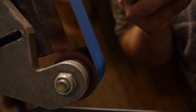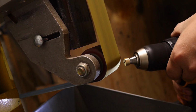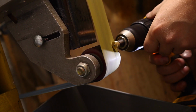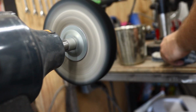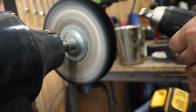The very last stage, I'm flushing off the end of that steel dowel with the brass, and then I'm clamping that brass nut in a drill in order to polish it. And I find a drill like this works as an awesome small device holder. Like, you've got this little mini vise there that you can use to clamp in little parts for polishing and things. I use it often, and it's just perfect for the case of this little brass nut here.